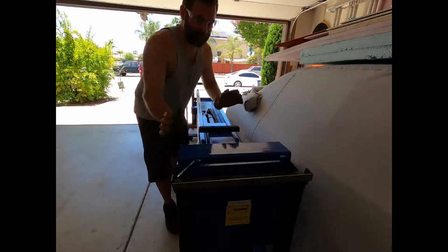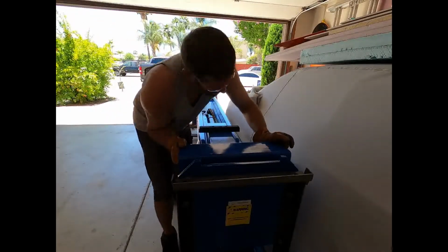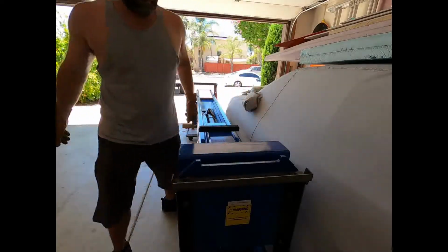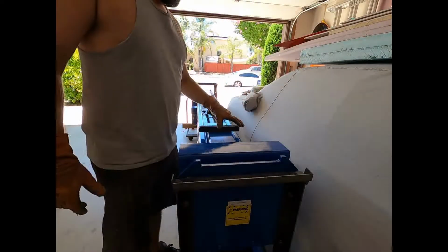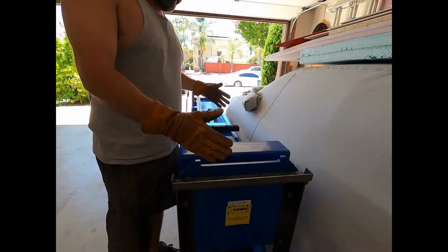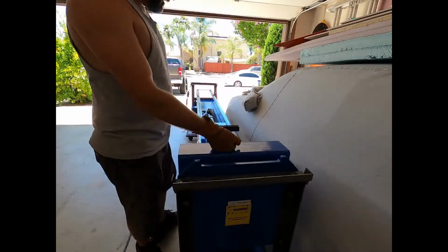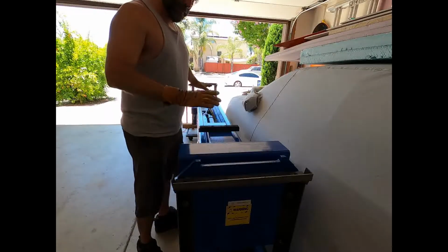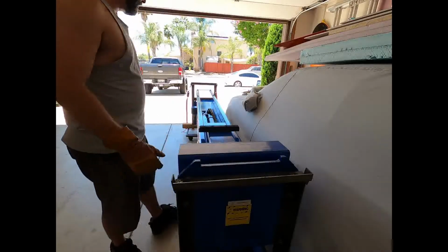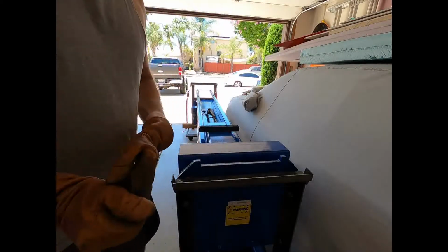But all I was going to do was try and secure this thing to the bottom of the hoist, so that way when I'm cherry picking this thing up, this does not move and the weight doesn't automatically adjust, and then the whole thing will just come off the cherry picker. So at least if I can secure this to the bottom, I should be able to figure out my weight and balance, my center of gravity, if you will, when I lift it up. So let me do that. You guys just hang tight here. GoPro, stop capture.